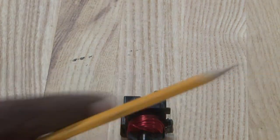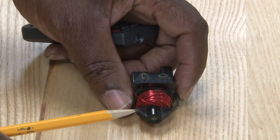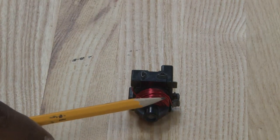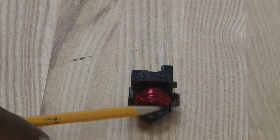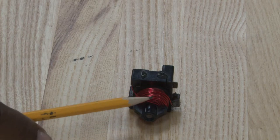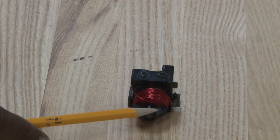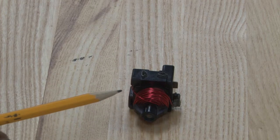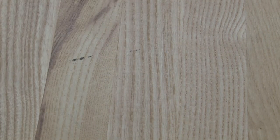The current relay, again, is normally open. It will close once it starts up because of the inrush current. And as soon as it gets up to speed, it will de-energize again. It does a lot of motion, so that's one of the reasons why we use it on smaller compressors — because it could damage the contacts if high current was going through it on a regular basis. So these are the differences in electromechanical type relays.